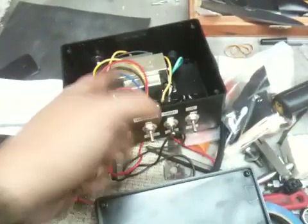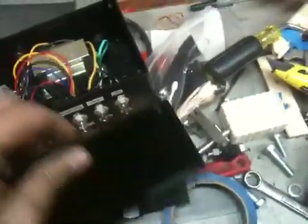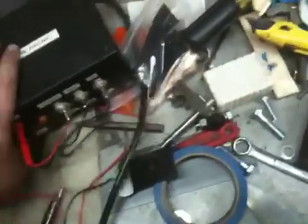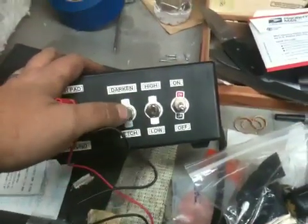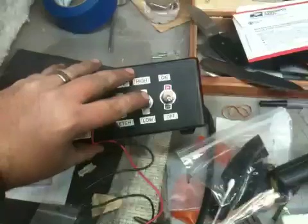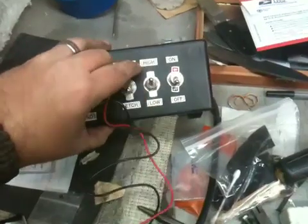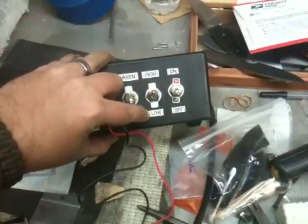As you can see, not too complicated — I'm just going to wire everything up according to the schematic, and it really fits in a nice little package. As far as the settings, it's just got the on and off switch, everything is labeled. You have a switch to switch the bridge rectifier to give you AC or DC output. I went ahead and tapped the center of the transformer, so I have a 12-volt setting as well as a 24-volt setting — kind of a low and high. For the most part I really only use high, but the low can be used as well.